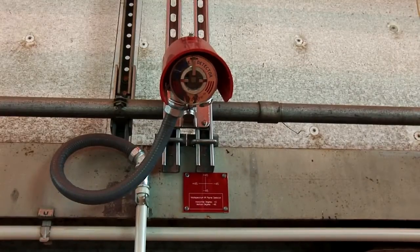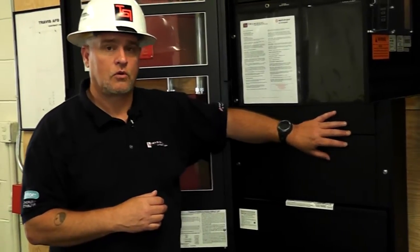So now we have covered an alarm situation, voice feedback — as you can see, everything is one button and push. Resetting the pull station is pretty simple. Also activating, enabling, and disabling a point — which would probably be the IRs out in the hangar for any welding. We've also gone over how to silence the panel and acknowledge it. If there is a power outage, these will go for 48 hours and 60 minutes of alarm. So that's a long time — great backup.